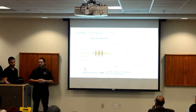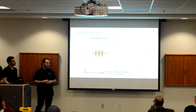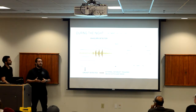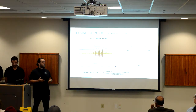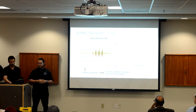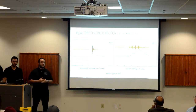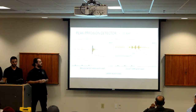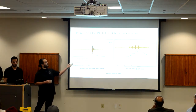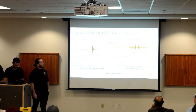Once night is upon the Cricket, one mic will be active and listening. The rest of the device will be asleep. Once a noise has been detected that meets or exceeds the noise threshold, the unit will wake up and enter its next mode. Here we can see the effectiveness of the peak detector. Not only does it act as a wake-up for the device, but it was also designed to ignore impulse noises shown on the left and recognize periodic peaks or chirps shown on the right.